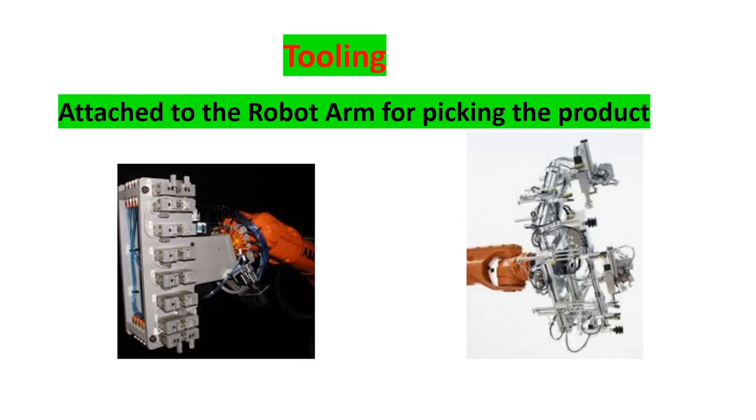Reminder: if your robot has tooling, you need to drop it in a rack or a cart, because sometimes your robot is located in a tight space, and once you execute the calibration routine, you could hit the guarding or fence of the robot.